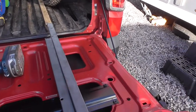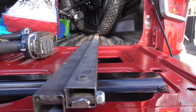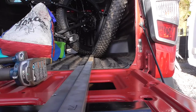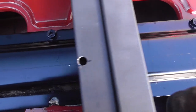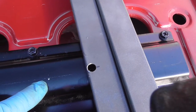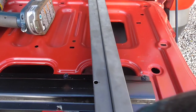I've got the framework in place with the hinge bolt mechanism — you can see the step, so when it twists up it doesn't collide with the frame. I've got it lined up with that bit of wood just sitting in the channelling, which squares it all up. Sorry about the geese being noisy. I've put a centre drill down there and I'm going to drill and tap it into the metal — it's not very thick but it should hold a thread. I'm going to do this off the tailgate so I don't get any swarf down in there.